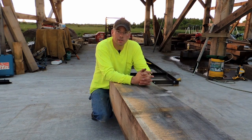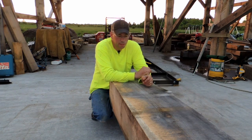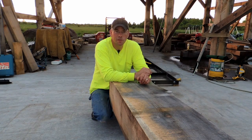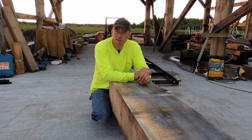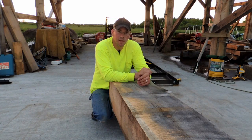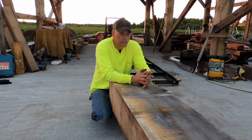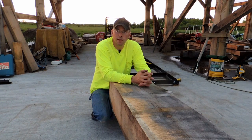If you're watching this and you're going to give it a thumbs down, I get it — too much talking, but I'm just trying to explain for those who want to do one of these. A good explanation of this joint is important because this is such a critical joint. Most of your joints in the timber frame are critical — each joint is relying on another joint to make everything work. These joints are very critical; you want them to line up right. I've had a couple where they're a little bit off, nothing major. But you don't want something you have to live with.